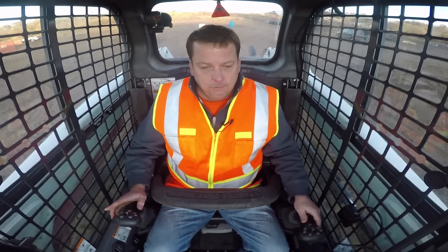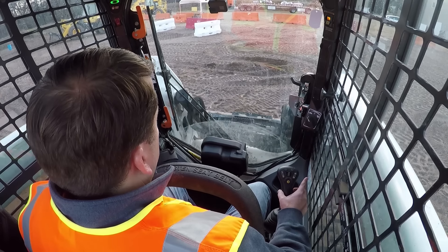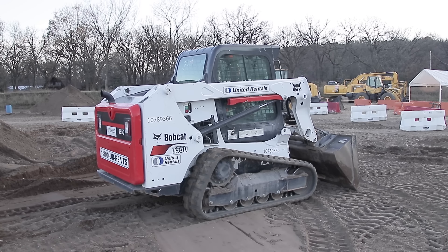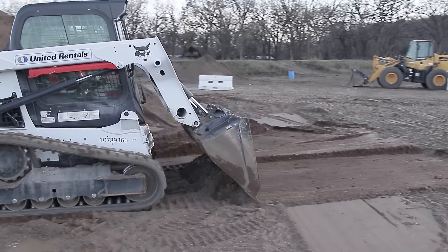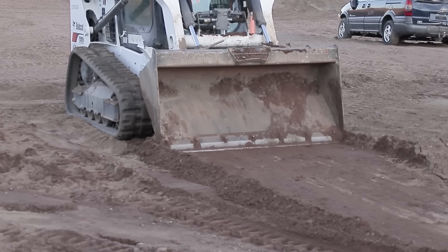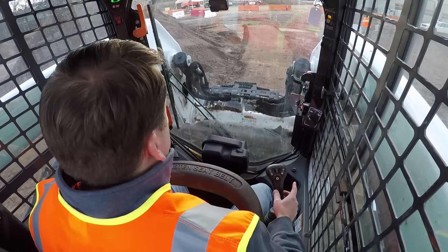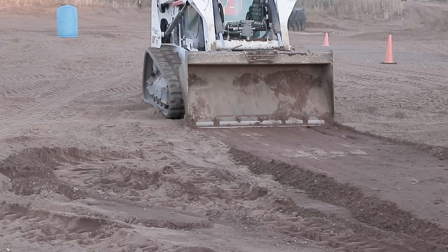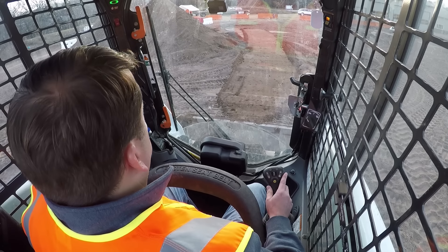The other way, if you're dealing with a really rough surface, is to float the blade with it angled down. Same strategy — put it down flat, hold that yellow button, and then I can actually roll the blade up. You never want to be over a 45 degree angle. Now I back up and I can actually see behind it — I'm getting a little bit of dirt behind the bucket. This is good if it's really rough and you're trying to fill in some holes. At the end, I'm just pulling it out of float again, and then slowly dragging it out to get rid of the material that's there.